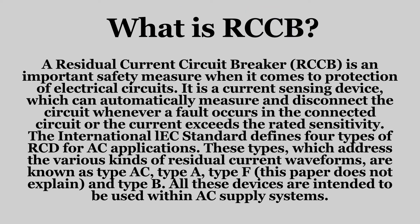RCCB — the residual current circuit breaker. This is a type of circuit breaker which acts in milliseconds and acts on leakage current. Pole-wise, it has two, three, and four pole versions, which are single phase or three phase. RCCB generally acts on the balancing load curve, meaning the phase and neutral ampere ratings are the same.